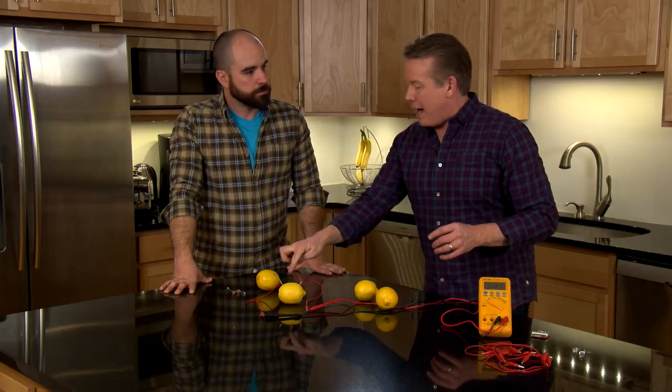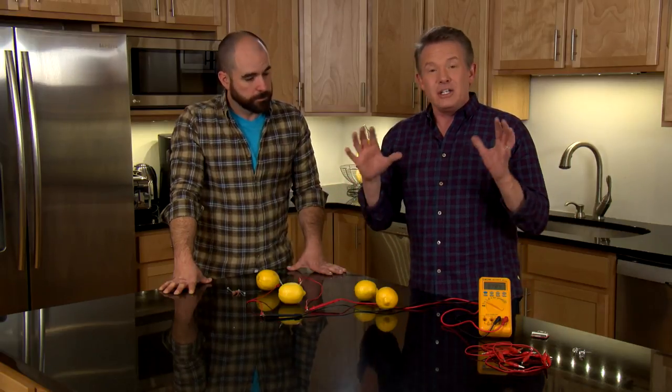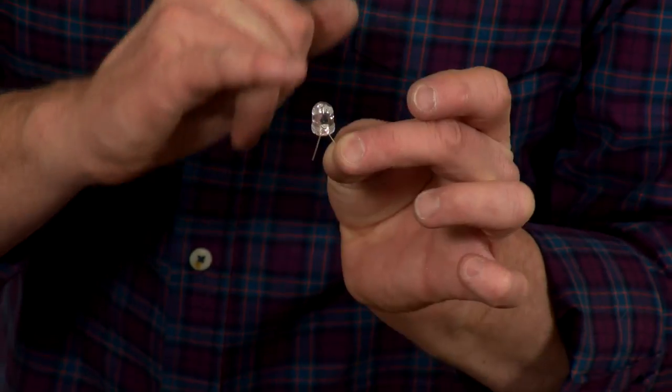So I think we're going to have to hook them up in series — just like taking batteries and hooking one into the next to the next, we can add up the voltages. So this one is 0.9. Another one in here will give us 1.8. Another one here is 2.7, 3.6. So it should be about enough to power an LED, because an LED is between a volt and a half and about three volts. Let's see if we can make it work.